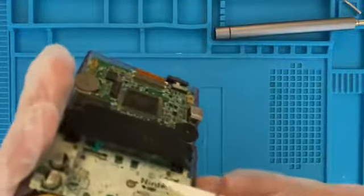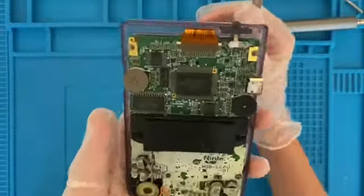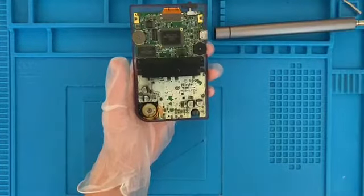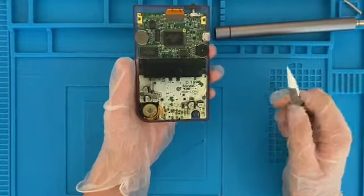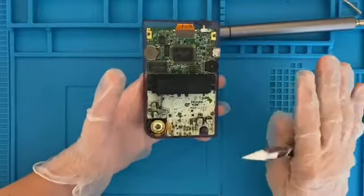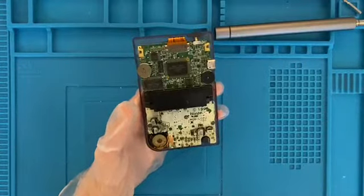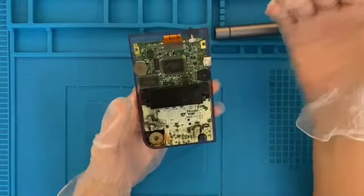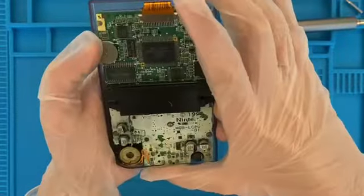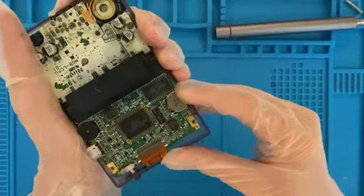Not confident I'm going to be able to fix this, but I am hoping for two things: one, that I'll be able to salvage this for parts, and two, that the screen won't be damaged, because there is nothing on a Game Boy Pocket screen that can be affected by corrosion — there are no components that can go bad, it can just go dirty. So I'm hoping the screen will be fine. The contrast wheel literally doesn't move — I'm having to push very hard on it and it is only moving a tiny bit. And the volume wheel is about the same.